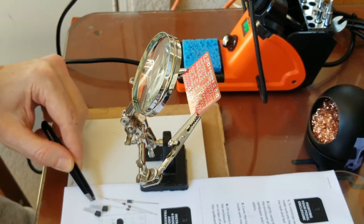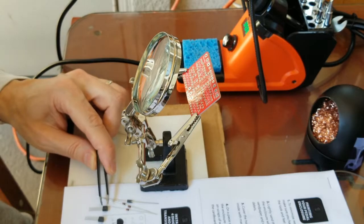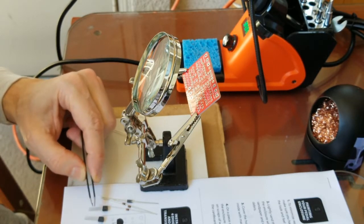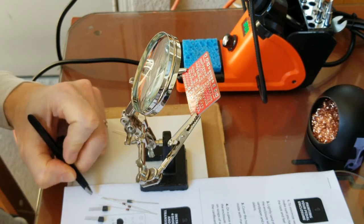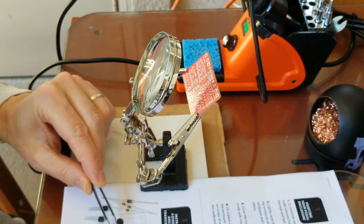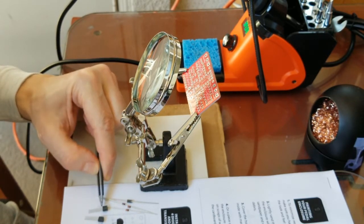So we're going to be including a few diodes, and we got our transistors here. Transistors are like gates or valves, but they're controlled by, in this case these are probably NPN. Looks like NPN transistors, which means that the current flow through the transistor is regulated by another current. So if you had like a 9-volt battery to power some circuit, and you wanted to control the flow of that 9 volts through here, let's say it was 500 milliamps of current, you could control the opening and closing of this switch with a smaller current.